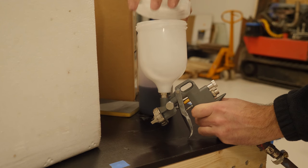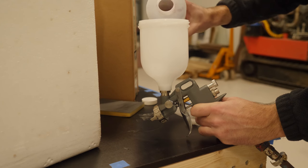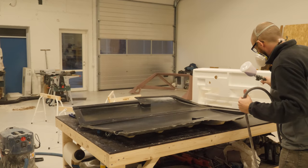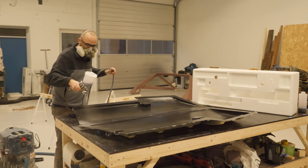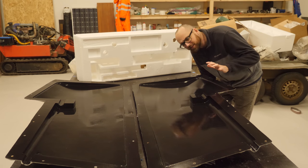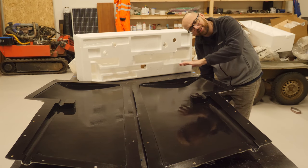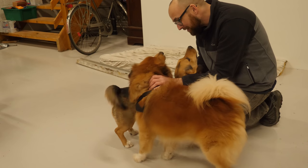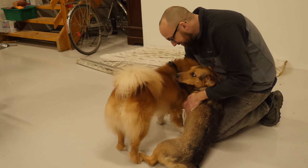For this project I'm going to be using three different types of glass. Once I've gotten the wax on and cleaned my fingers we can take a look at the glass. That's two coats of wax — I think that should be plenty, considering I'm also going to spray these with PVA. Let's get some PVA on those molds — I've moved both of the dogs into the office. There is at least one dog hair in here, but that's okay, that's just what's going to make this rudder unique. You guys are going to be a part of that rudder forever.